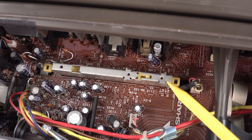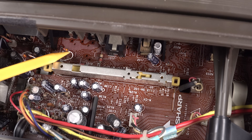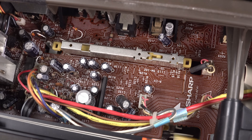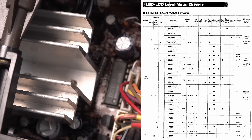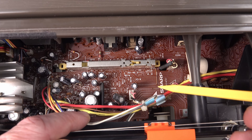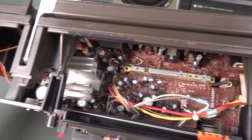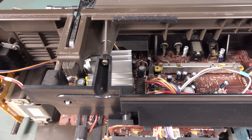Let's have a look at the main PCB. Common stuff we see in here is this multi-gang switch along here — you can see that armature coming up. When you do some of the functions it physically pushes the lever over to a multi-way contact. Big custom jobby. There's a diode up there — supposed to go across there but it's got insulation on it and it's looped out. What the heck? Another common thing you saw in the 1980s: single-in-line packages. Highly underrated, the old single-in-line. I've got a DIP over here — it's actually a Sharp part, IR-2E01. Sharp manufactured a lot of their own parts.